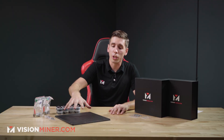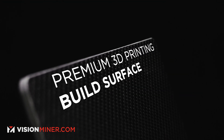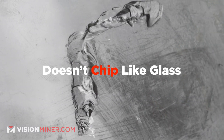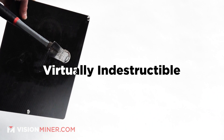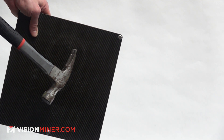Next we've got our carbon fiber plates. These are plates that we've custom developed for ourselves because we were breaking glass all the time — whether the parts stuck on there too well with PEEK and Ultem, or you accidentally let it cool down for too long and it pulls chunks out of the center of the plate, or even PETG using nothing can pull chunks. We see this all the time, ABS as well. These carbon fiber plates will not break. You can throw it at the wall and it won't break — don't recommend doing that, but you get the point.